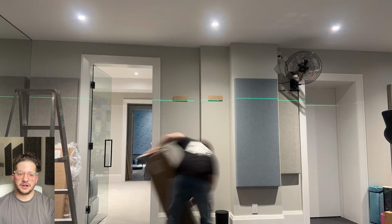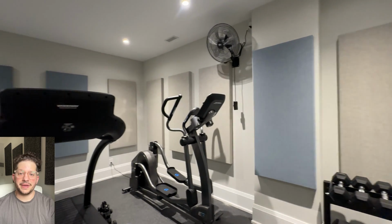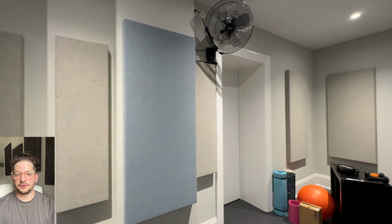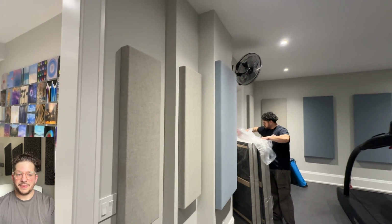So we just adjusted our laser to account for the little bit lower of a height and just follow that same step. We do 2 pilot holes through the cleat, so that way we make our holes in the cleat and in the drywall. Then we drill it out, install our drywall anchor, and then screw the cleat into the anchors. And then your panel is ready to hang. So there is all of the wall panels mounted.